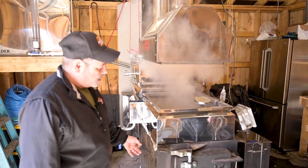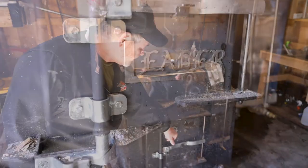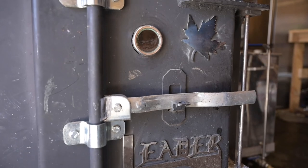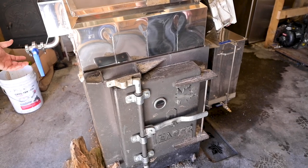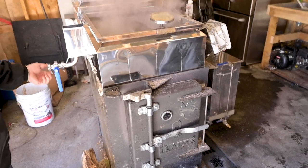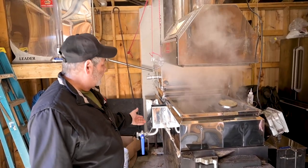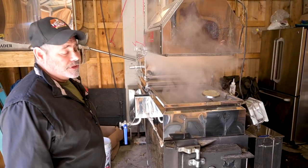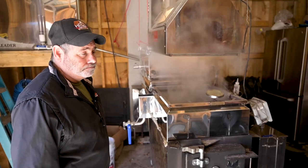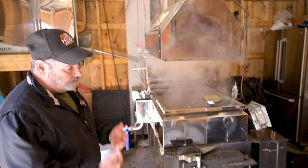The Inferno Arch is a forced air arch with an airtight door. This one has a window so you can see into the firebox and monitor your fire. It produces a much hotter fire because you're supplying extra oxygen, which gives you more BTUs out of your wood. The pans are American drop flue, meaning the flue pan has drop flues that go down inside the arch seven and a half inches, giving you excellent BTU transfer because the heat is direct on the flues.